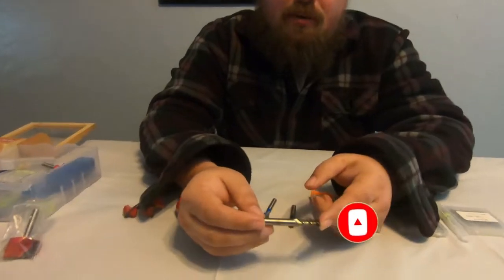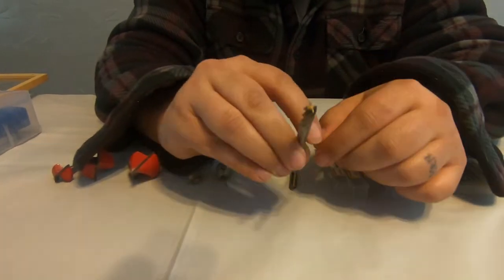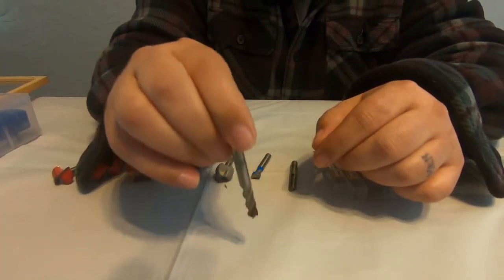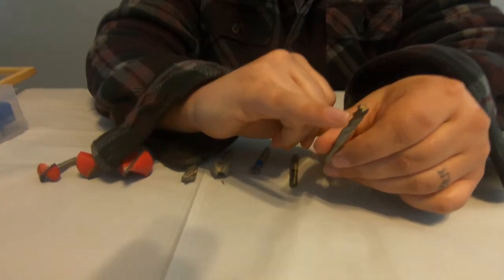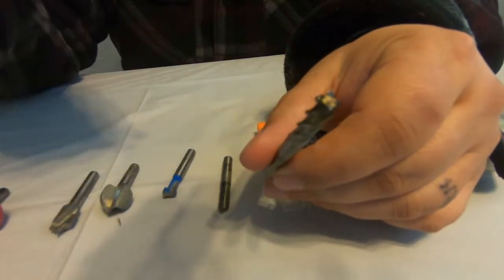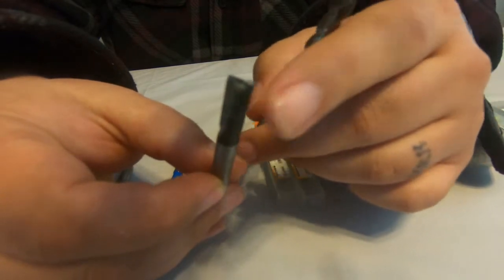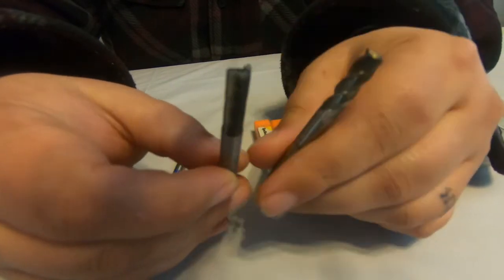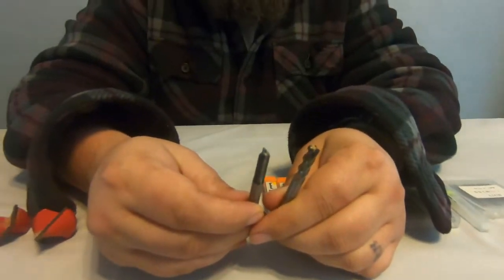So this is what came with the Shapeoko. It is a quarter inch end mill — flat, it cuts a flat surface. It is a four flute; each one of the cutting spots is a flute. So this is a spiraled four flute. When you look at what you'd normally use with a router, that would be straight and two flutes. So that's the difference in what those look like to start with.